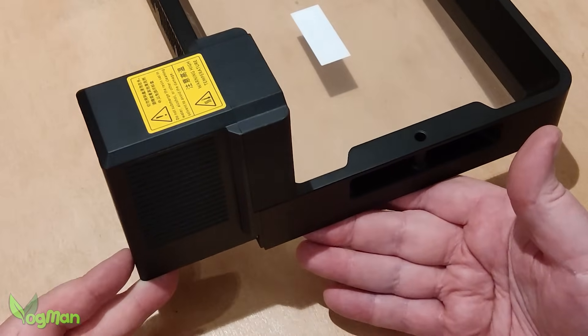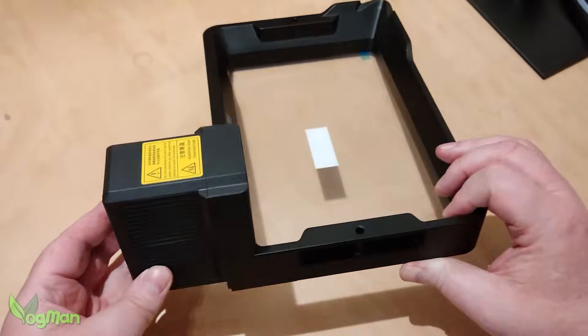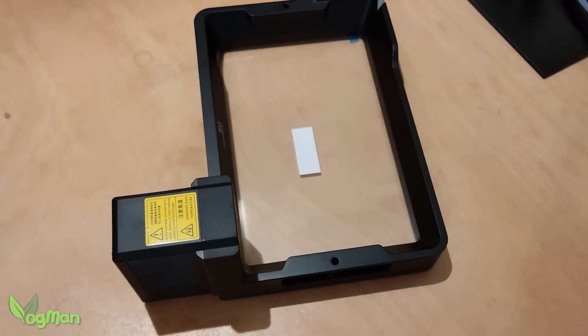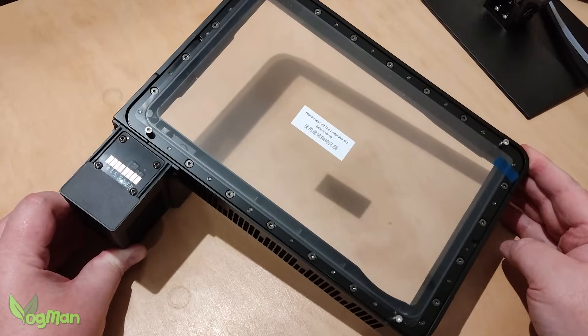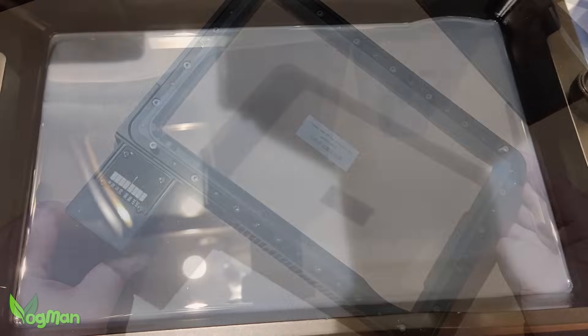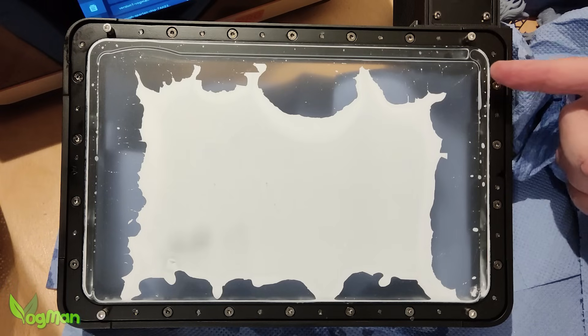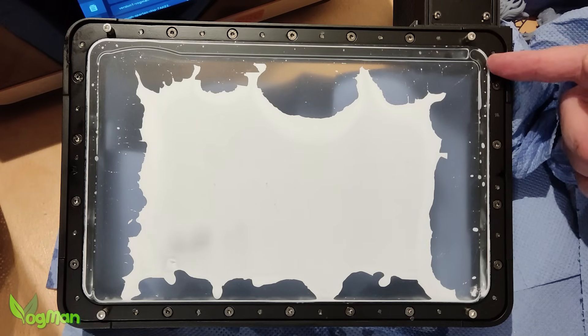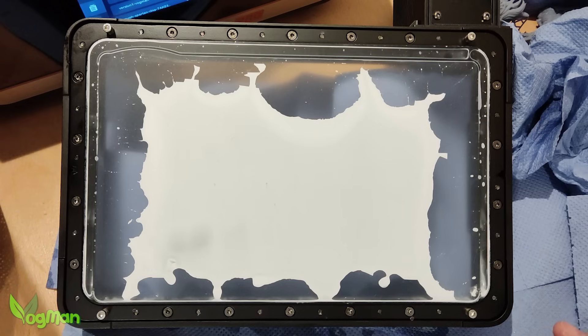In the past, I have always lived by the notion that it never hurts to take a good long hard look at the backside, and on this occasion I failed to do that. The evidence was there in the beginning — see these holes? Now I did try in vain to prove all of this by running the standard heating cycle, but in fairness there was nothing much to see. So I emptied the resin tray out and flipped it over. This suggests that resin has come into contact with these channels around the edges of the FEP.